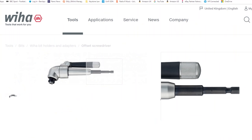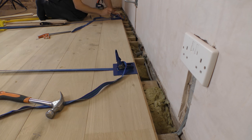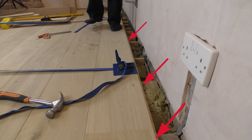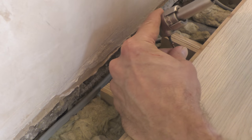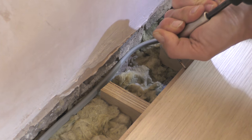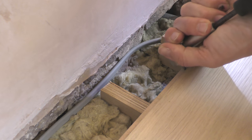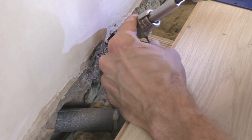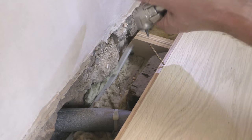So enough of the intro - let's look at a couple of jobs I've done recently where this tool has really come into its own. The first was laying some new floorboards in our bedroom recently, and I couldn't get my drill driver in at the right angle to power in the tongue-tight screws into the joists because the last floorboard was too close to the wall. As you can see here, the offset bit driver made light work of operating in this tricky space - first using my impact driver, which as I said the bit is strictly speaking not designed for, and secondly using my combi drill set in non-hammer action screwdriver mode.